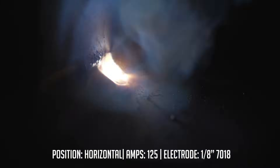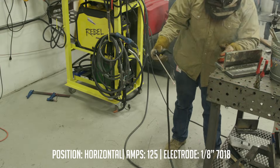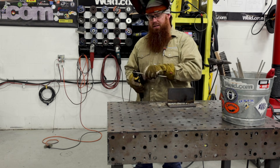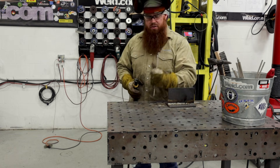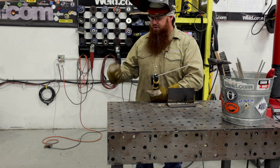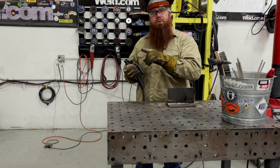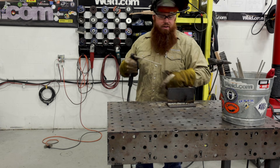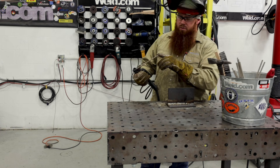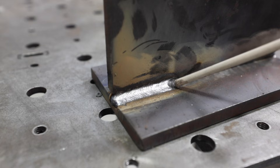Once I terminate a weld, I typically flick the electrode. That little glowing molten metal ball on the end will fly off and leave me with a bare exposed electrode. So instead of taking the electrode out each time and smacking it on a table or the concrete, or dragging it across something — as soon as you get done welding, before you even lift your hood up, just flick it real quick. You'll knock that ball off, expose the bare core of the electrode, and the rod is ready to go back into action.